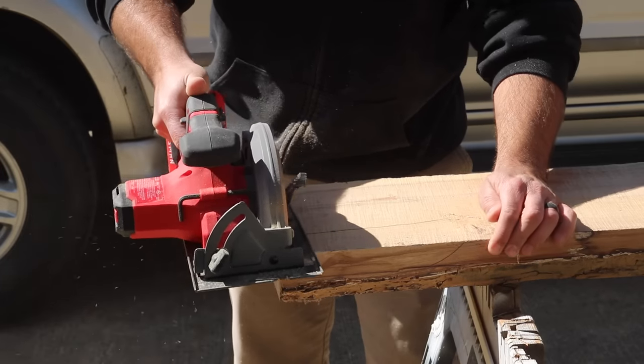When it came time to mount this, I had no problem securing the patio bar top to the fence. I had the supports there with pre-drilled holes, so I could secure the slab with a couple of screws on each support. On the back side, I had that extra 2x4 with pre-drilled holes, so I could install screws from the bottom side up into the slab to hold everything in place nice and secure. This thing's not going anywhere — very happy with the way it turned out.